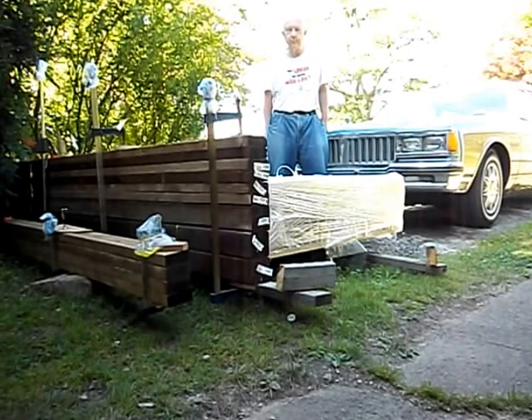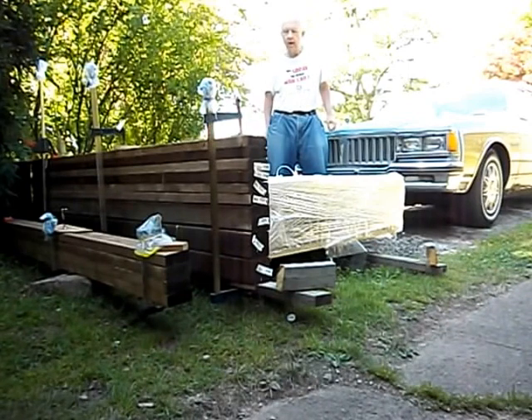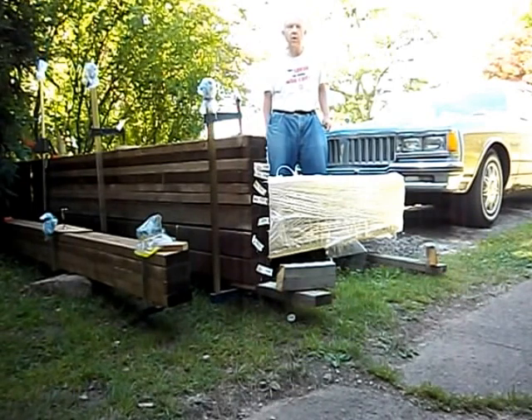I bought most of the wood at Home Depot recently, and I've got some really old wood that's well seasoned and won't warp anymore that I'll use for certain parts of the building. The slit is going to be sort of like a dome-like structure, approximately 5 to 6 feet wide, which is quite large for a small building. That will allow better seeing conditions because any warm air left over from the daytime heat will quickly rise out, and the building inside will reach thermal equilibrium very rapidly after it's opened up.